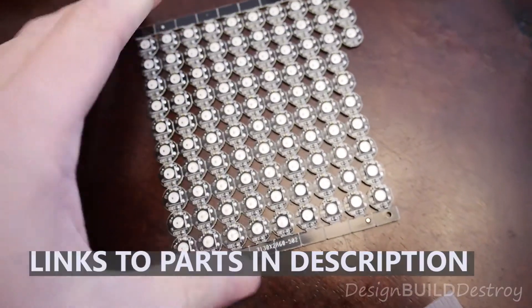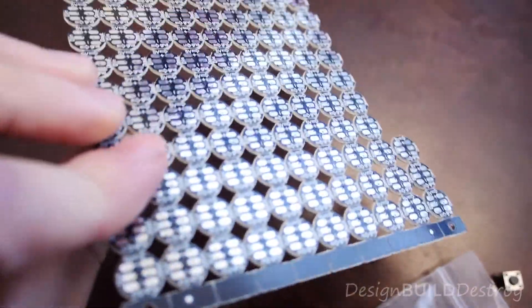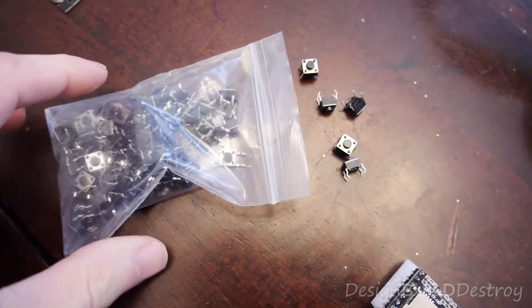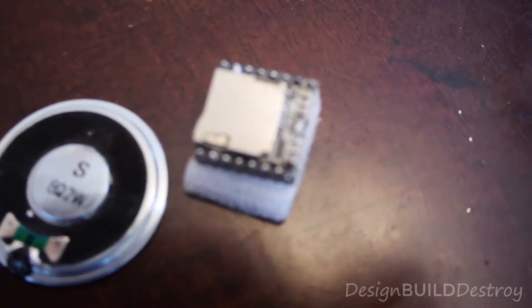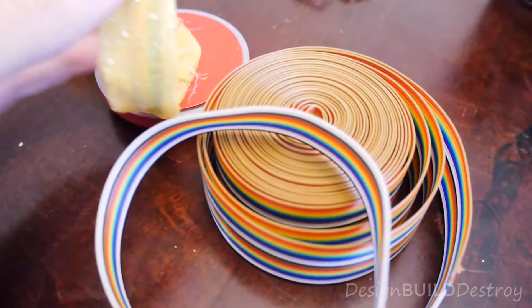I figured I'd need an Arduino Nano, six individual NeoPixels — not the strips, the individual LEDs — three push buttons, and a DF Mini player with a speaker and a very small SD card for the sound. I also needed some ribbon cable to make the connections from the front pack that go up around the shoulder to the backpack and to the Nano itself.